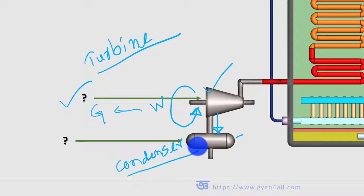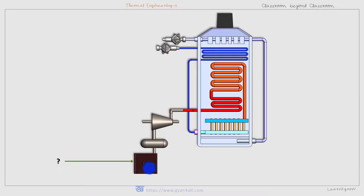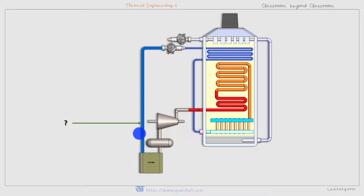As the name implies, the function of a condenser is to convert the steam into water through the process of condensation. The condenser is basically a heat exchanger in which cooling water receives the heat from the steam and the steam is converted to water. The water collected below the condenser is collected in the hot well, and this water can again be reused as boiler feed water by pumping it back to the economizer via the feed water pump.